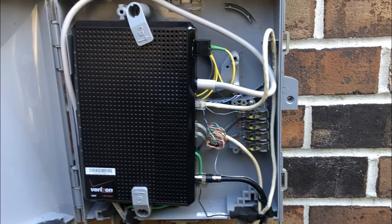Moving up from that is the CAT6 line which was run to my router. When you pay for gigabit service, you cannot get that full capability — or at least have it stable — over a distance over coaxial cable. So instead, at the ONT they run a CAT6 cable from here to the port of your router. If no other device is using data on the network, I usually range around 950 megabits per second, which is pretty good and close enough to gigabit.